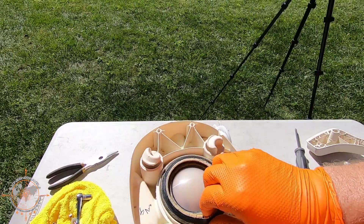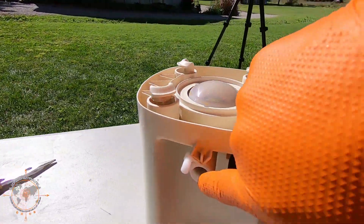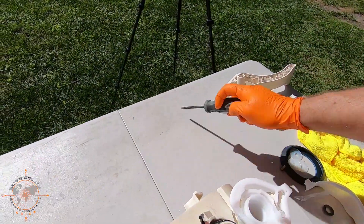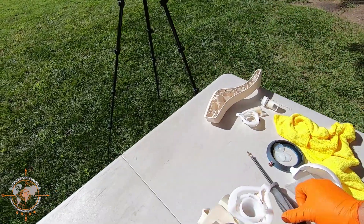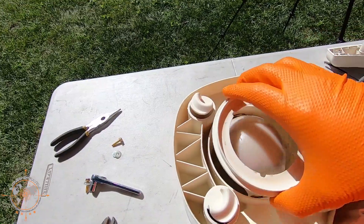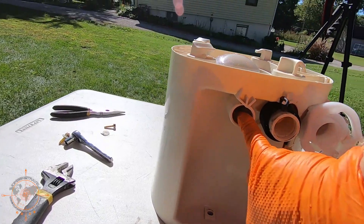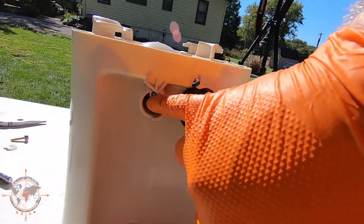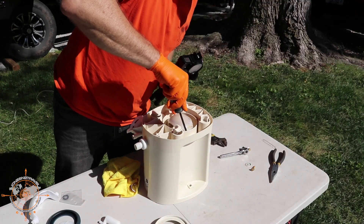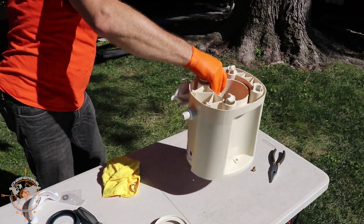Now this is pretty simple. We've got to pull out this gasket right here and discard that. First we're going to take this screw back out and pull this arm back off — there's the screw, there's the arm. So here's the ball valve. We'll pop that off — it's got a little seal on it, and this is the side with the arm. We're going to take a screwdriver and kind of pop this out from the other side, and the whole ball valve will just drop out.